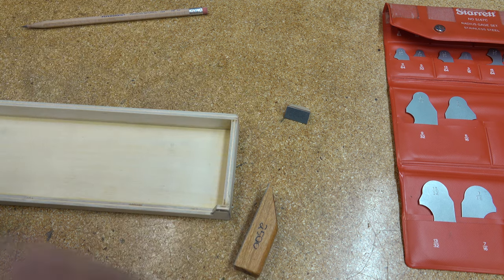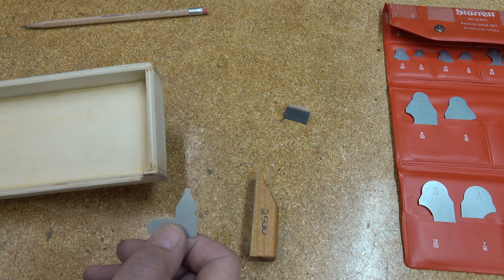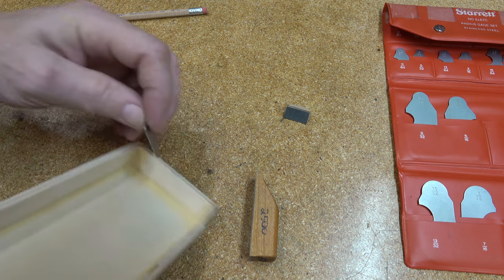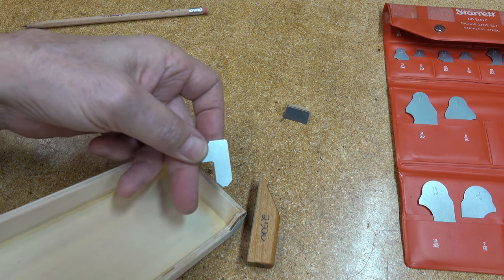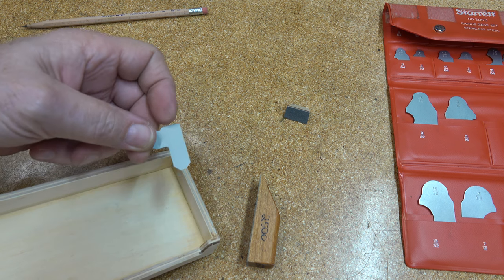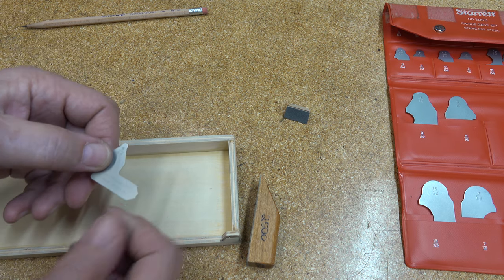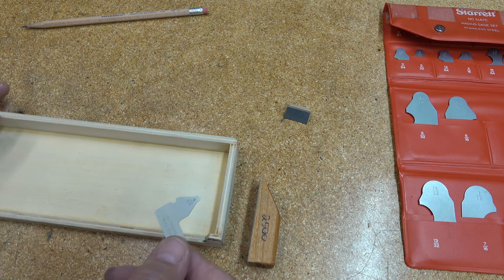This is just my tray for these little blocks. But this is just to show you how these can be your friend in so many different circumstances, whether you're using the nose. The back edge here is a perfect 90, so you could drag this in here too and do the same thing to put the fillet in. But obviously your fillet would be the other way, right? It's just a very versatile tool. I use these as scrapers because these are hardened. This is a Starrett version, but they're available pretty cheap offshore.